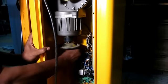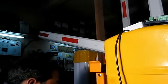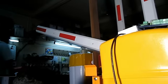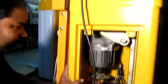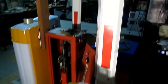You rotate the handle clockwise and the barrier is getting up. If you stop it in between, the barrier stays in that position. When power comes back, it will auto reset and you can now open or close the barrier.